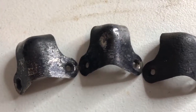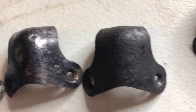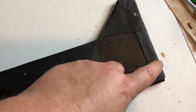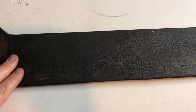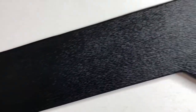These were horrible and this is a large improvement over what they were. I really wish I had done a close-up before shot because these were practically all rust — anywhere you see chrome is about the only chrome that was left. This is the before of the lower back panel. Now for the upper panel, which I had to rebuild because the wood was chipped out pretty heavily. I put back every piece I could with super glue and used wood putty to fill out the rest so it could go back together. All of the Tolex was torn off and this whole end was flopping around, so I used contact cement to re-seal it all.